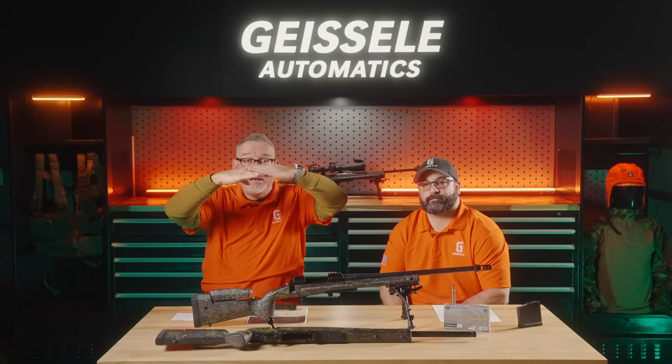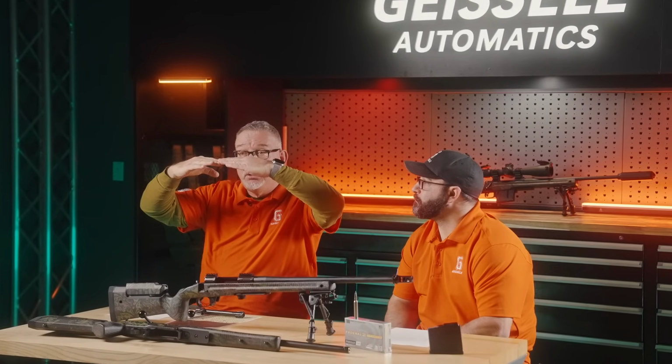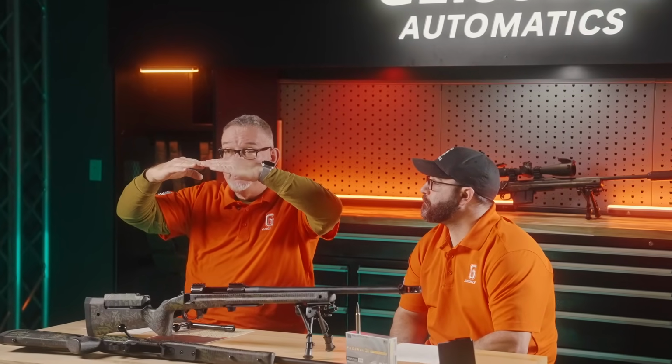The genesis for our Super 700 was a precise 2-stage pull that is also drop safe. One of the key things with this trigger is it doesn't have a small sear engagement. Just like our renowned triggers for the AR-15, it's 2-stage and you have large sear engagement. You are not sitting on a knife edge. Just about every other trigger out there that I've ever seen sits on the knife edge, whether it has rollers, whether it has balls, whatever it is. Do you want to have your trigger sitting on a knife edge while you're out walking around with your kids?